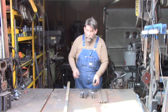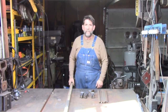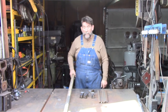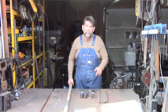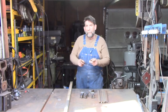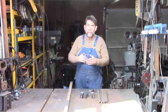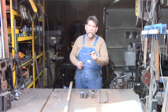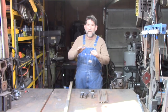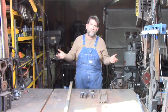The way we normally do this is I take a piece an inch and a half, which is quite heavy, and I put it underneath the power hammer. I put a spacer an inch and a half out from the edge of the die, and I start fullering it with the power hammer, and it leaves me a cube inch and a half by inch and a half. It also tapers down, and it works real good for finials on the ends of things.